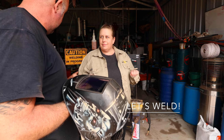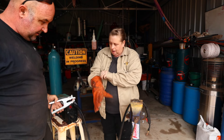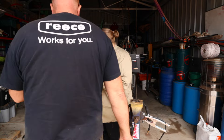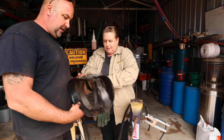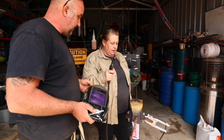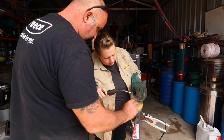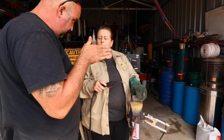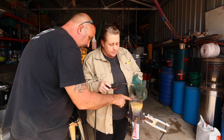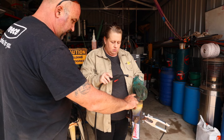I think we've covered most stuff — you've got sleeves and we've got gloves. There's a righty and a lefty, and you're wearing both of them. We'll see how you go with the trigger because I find it difficult with a glove on, so just put the left one on. Now, there are gazillion methods and techniques on how to weld — we're not covering any of them today. We're just getting Mrs. RP to join two bits of steel together. What we'll do is a little tack on the end — hold it in the one position for maybe two to three seconds. That'll give it a little tack weld to hold it, then put one at the back on this side. That'll hold the pieces together, and then I can remove my hand because that bit will stay there on its own.